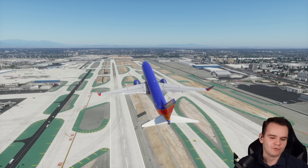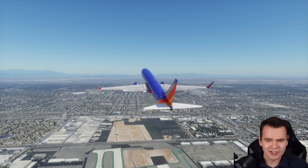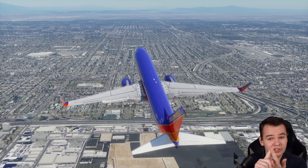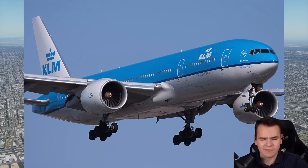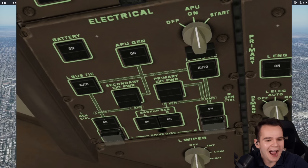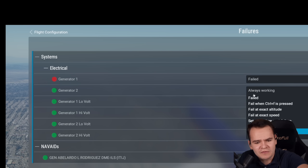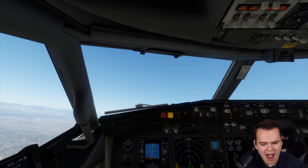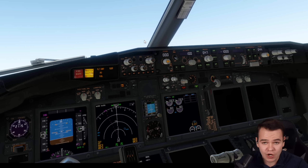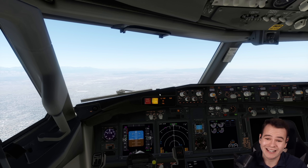Now, yes, it is very annoying to fly without an APU. But the question is — is it unsafe? The APU really does offer some redundancies. For example, what happens if both generators on the engines fail? This is a 737 — it only has one generator per engine. Bigger airplanes like the 777 have to be able to fly across oceans, and have two generators per engine for backup. What happens if generator one, generator two both fail? We're losing power, and we cannot now turn on the APU because it's broken. In real life you would do that, but still, the airplane flies, and as long as you're not flying long distances, this is no problem.